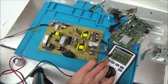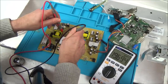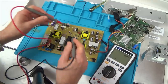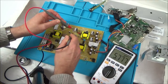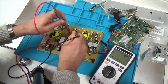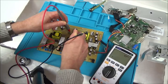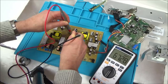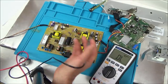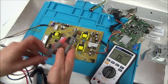The other resistors are reading 0.27 ohms but coming up as 0.7 ohms - still well out but maybe that's okay for in-circuit. But this one above is in the mega ohms, and again this one here is also in the mega ohms. Whatever 63 kilo ohms is, it's still well away from nearly short. Basically these two are definitely failed as far as I'm concerned.